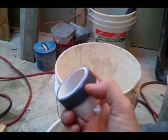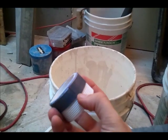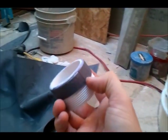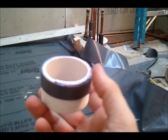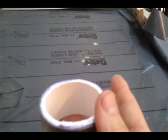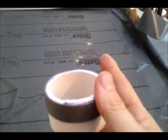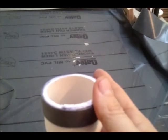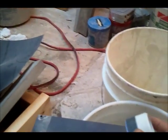water protection. Again, we've got the seam right here, but when we glue that up, the glue is going to flow into that seam. And anything that were to get past this, just the same, we've got a tile floor that's porous at the grout joints. Now we've got the waterproof liner in place. Any water that gets past that will hit this liner, and because the liner itself is sloped to the drain at the weeps, it would then go on top of the liner and into the weeps. So again, notice the tight fit here.